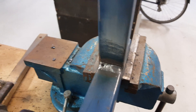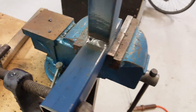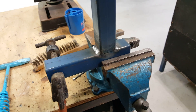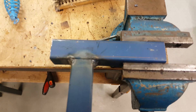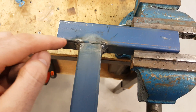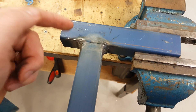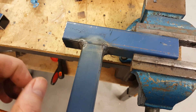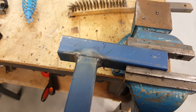I went over the other side as well and still managed to get an inclusion for some strange reason, but I'll just do up these ends and we'll have a fairly solid weld. Now with this weld we're going to go up against the edge of the steel — this is a bit thicker so you can put a bit more heat into it. Just kind of bias the amount of time you spend on this piece of metal and dab across when you need to to get onto this side, because that'll blow away too easily otherwise. I'll set up and watch another pass.